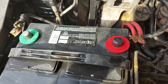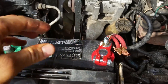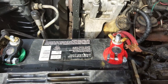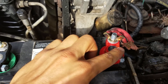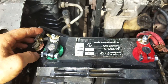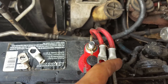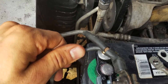I have the little corrosion inhibiting discs on there and I'm going to slide my new terminal on. You want to get these down flat as far down as possible, then tighten the nuts up — but don't go crazy with them because it'll mess up the shape of the lead. It's only lead, it'll deform. Just get them straight on there where you want them, perfectly straight, and tighten them down. Lay out your terminals and make sure you've got enough in the proper sizes — two on here temporarily, plus one for the thick wire and one for the little wire for the body chassis ground.